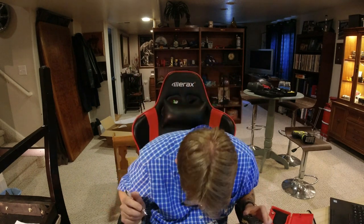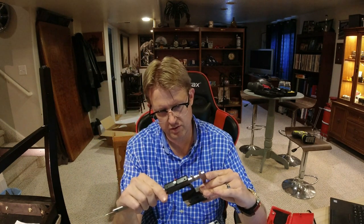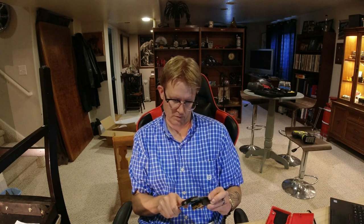So this guy is going to be 55. And we're just gonna draw a simple sketch. 55 millimeters, 60 millimeters. The holes are 13 millimeters, 13 diameter, and then they are not quite centered. Let's just say that they are 24. And then they are 13.